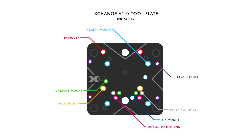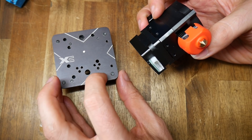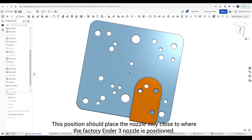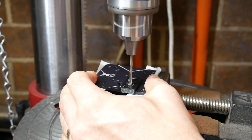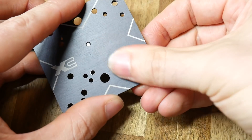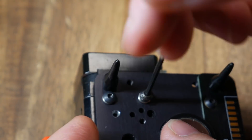The XChange tool plate already accounts for a lot of different hardware, but if what you want is missing there's still a way to get it done. To match the position where the Creality nozzle would sit, I needed two holes in the lower right corner that didn't exist, so I downloaded the step file of the tool plate from their GitHub site and modelled up a simple jig. It uses two screws plus the lip on the edge to locate, and the two holes line up with blank metal to drill through. I've put some tape over the magnet and other surfaces to protect them while drilling, and after that we've got our two mounting holes for the H2 in the perfect position. When securing the H2 to the tool plate, I'd recommend using some spring washers so vibration doesn't make the fasteners come loose over time.